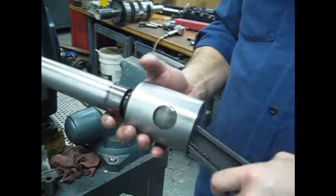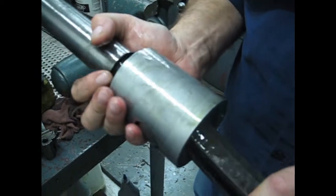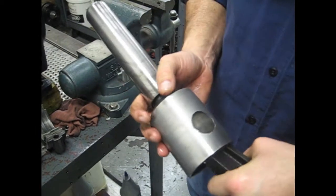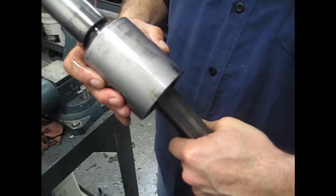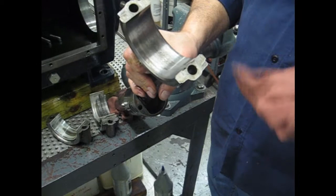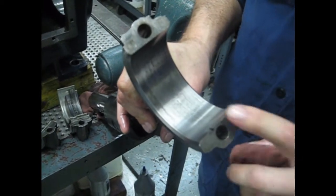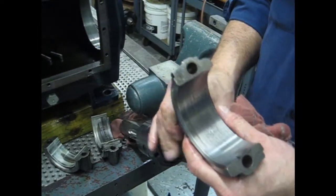Here, pull it out, get our crosshead section here. It's just normal wear on here. You see it's clean. Plungers look good. Our wrist pin is in place, still centered in there, locked in place still. You can see the bore for our shell bearing looks good. Everything's clean. Ready for a new one.